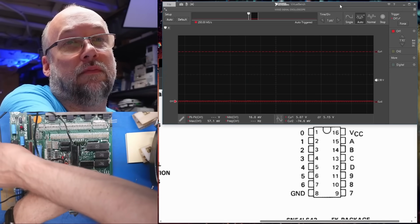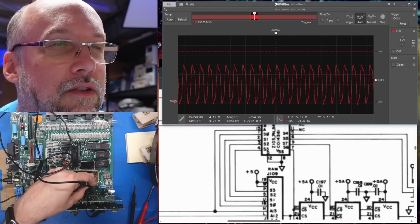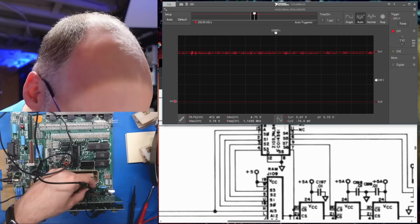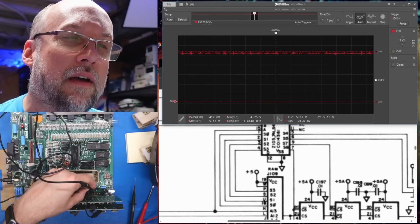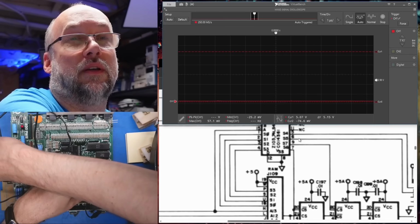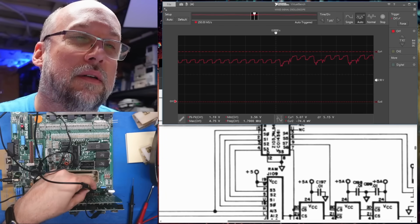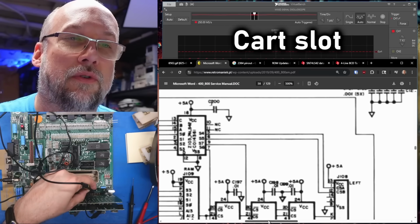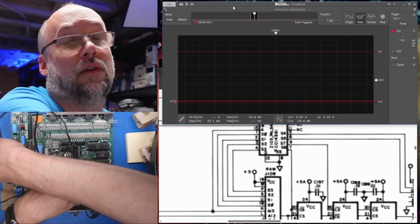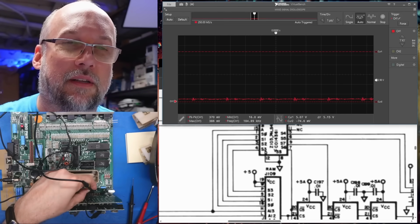So if we turn this on, it's at 1.7 megahertz. It's like the clock, basically. It's coming out of that S0 line. Okay, S2, pin 3, just high. Pin 4 looks high. Now S4, which was doing stuff. There we go. I don't know, it looks okay. But that's not a chip select line. That goes over to the CPU card, it looks like. S6. It's a little low all the time. Oh, there we go, some activity and then it stops. And now we have chip select lines.